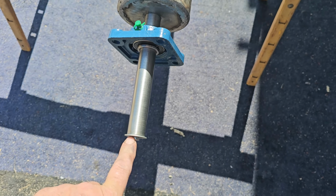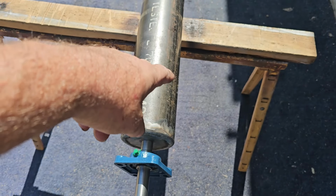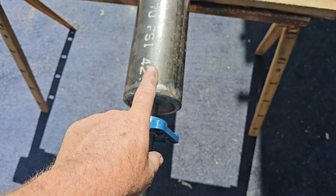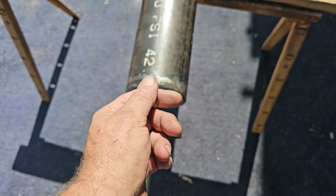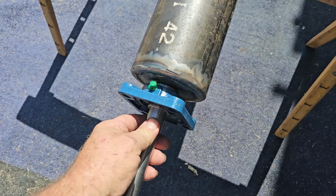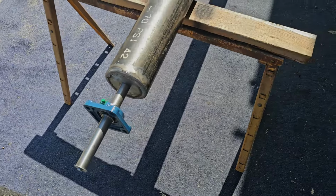The 1/4 20 hole, I knew the shaft couldn't turn 180 degrees inside of there, so I knew the threaded hole was facing me. I fished in there with a piece of 1/4 20 all thread, ground to a point, and I fished it in and just barely got it started in the end of the shaft, and I was able to fish it back out through the hole. Thank goodness. So it's a nice slip fit, and now I don't have to make a new shaft.